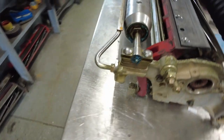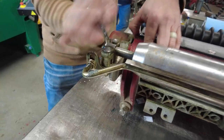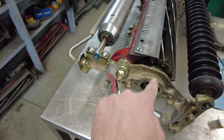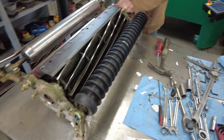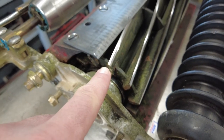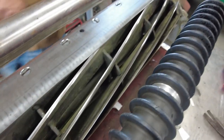These are pretty easy to mount — easier than some of the mowers in the past that we used to work on. Essentially just two bolts that go through, and then there's another one up here that you dial in and it sucks this up and pushes the bed knife down into the reel. These have been ground; they have about a 32nd to a 16th of a face there, and then a relief grind along the whole length of the reel.